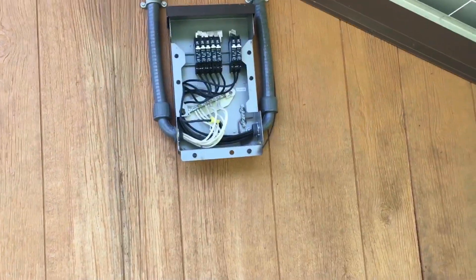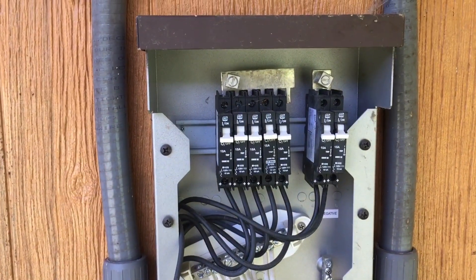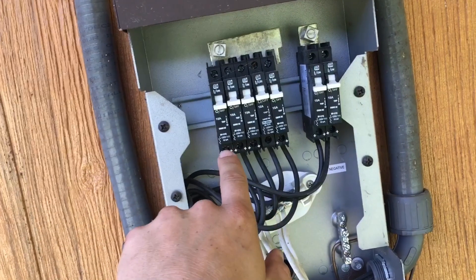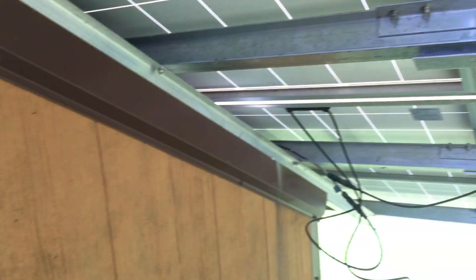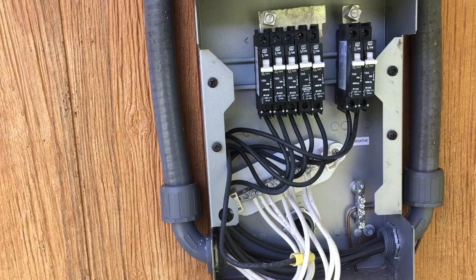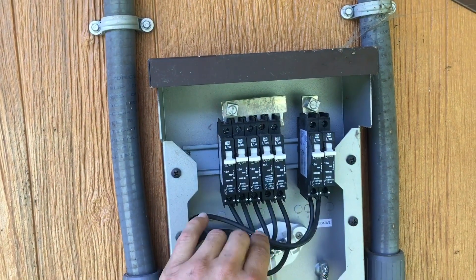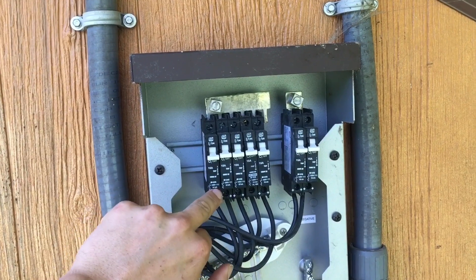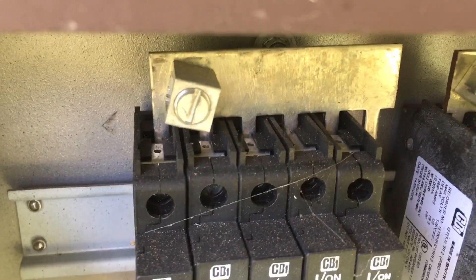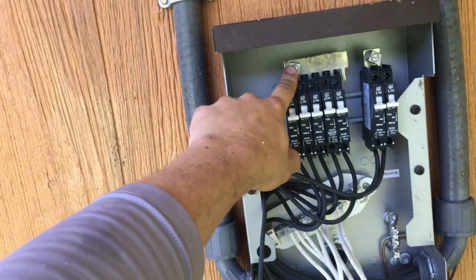Guys, this is a combiner box — this is what I'm going to call old school now. Basically all the solar panel strings are coming in through these two conduits, and each string of panels on this particular array is wired in strings of two. So they're making about 80 volts open circuit, around 70 volts under load. You can see all the positives from each string go through a breaker and then they get combined — the breaker teeth bite onto this bus bar. It's off so I'm safe. And then that's your output to your charge controller. This was a 48-volt system with a charge controller.